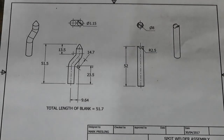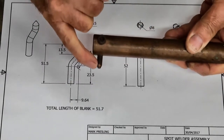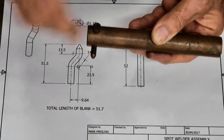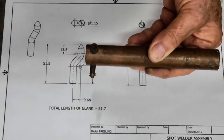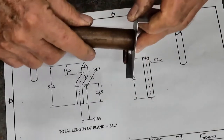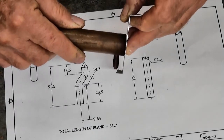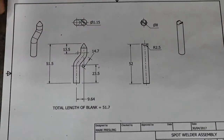The reason I want to do this is that the spot welder I have at present has a copper arm with an electrode fitted into a slotted end, held in place by a clamp bolt. The problem is there's a fair amount of offset - about 12 millimeters - between the centerline of the electrode and the end of the arm. If you're trying to weld very close to a face or a standing seam, it's simply not possible to get the electrode up close to that surface.